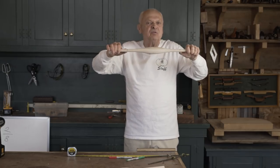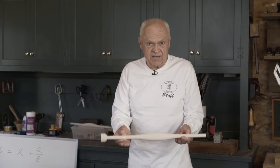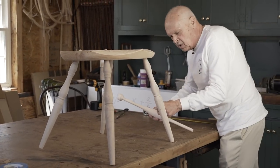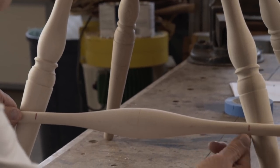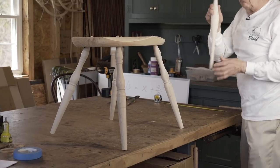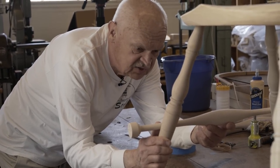I'm not going to trust this — I'm going to check this measurement and layout against the chair to confirm it's going to work. I'm going to align one red mark right here on the back edge of that leg at the height of the scribe mark, and place the other one against the leg. When I do, this mark on the back overlaps the leg — that's the quarter inch of preload. I want my stretchers to be interchangeable, so I'm going to check it on both sides. That works perfectly. When I lay out the second stretcher, I'll test it the same way.